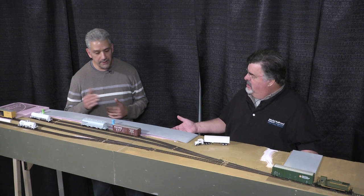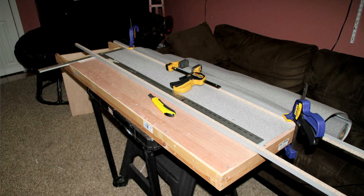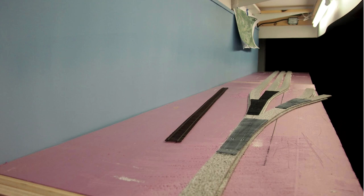So what is this bench work? They are 18 inches wide and each section is four feet long. There's foam on top of some sort. The construction is Luan plywood — a quarter inch thick — and a birch plywood covered with pink foam. And in the back there seems to be some sort of a frame.